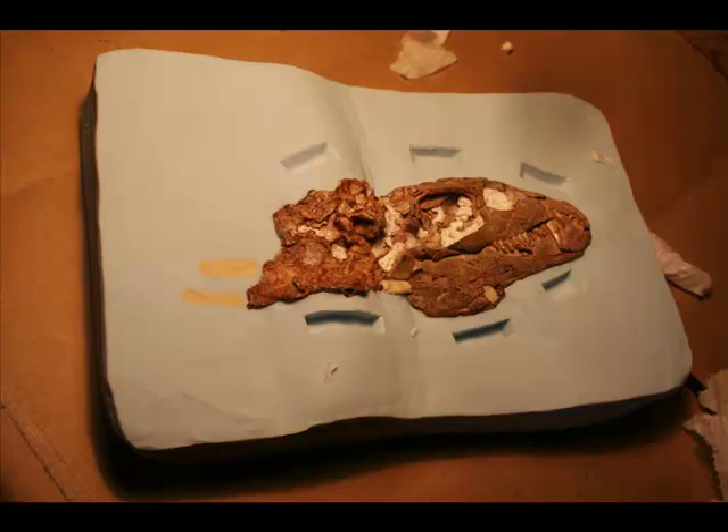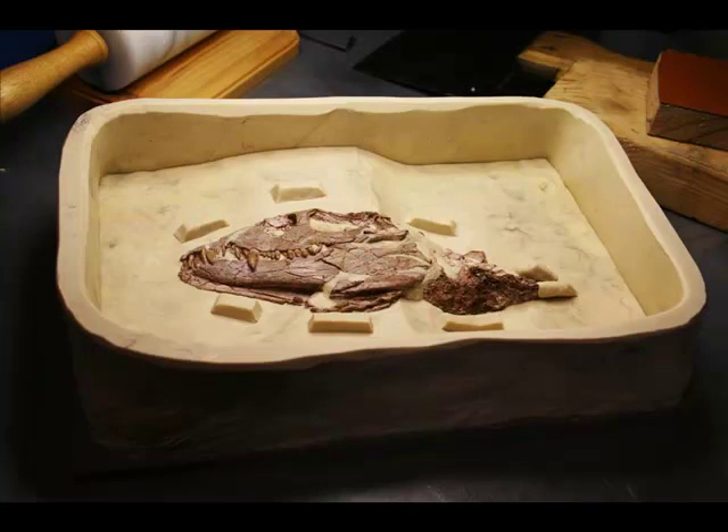One reason this works so well — in filling those cracks and crevices, we used Van Aken modeling clay. But in the bottom of the crevices, you don't want clay; instead, this is packed tissue paper, which is then covered with a veneer of modeling clay. On all the areas where clay was used, the surface is stippled with a mimeograph stylus. It produces a surface like a miniature golf ball with a series of dimples — unobtrusive, but immediately recognizable as not specimen, not bone.